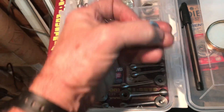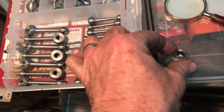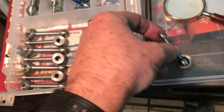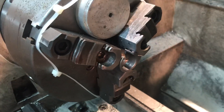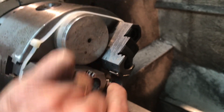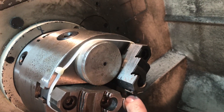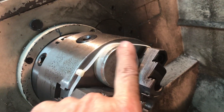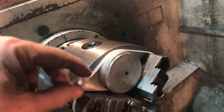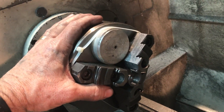Here's the little cup for the half inch — this is the George Thomas design. Let me show you how this fits in the lathe and the three-jaw chuck. You set that in, squeeze it with the jaw, and set the angle — that's what I wanted to show with this setup. It's kind of unconventional, but I have the cup in here and I played around with spacers in the back to give me the 20 degree angle. It worked out nicely because it was larger than the perimeter of the chuck jaws, so I was able to use little twist ties to hold it in place.